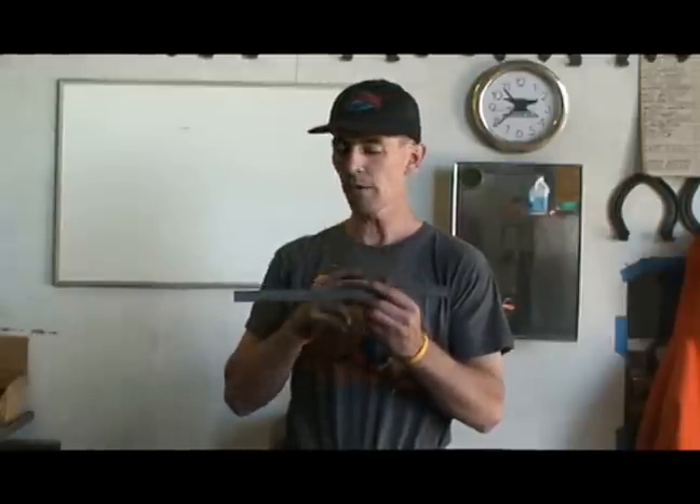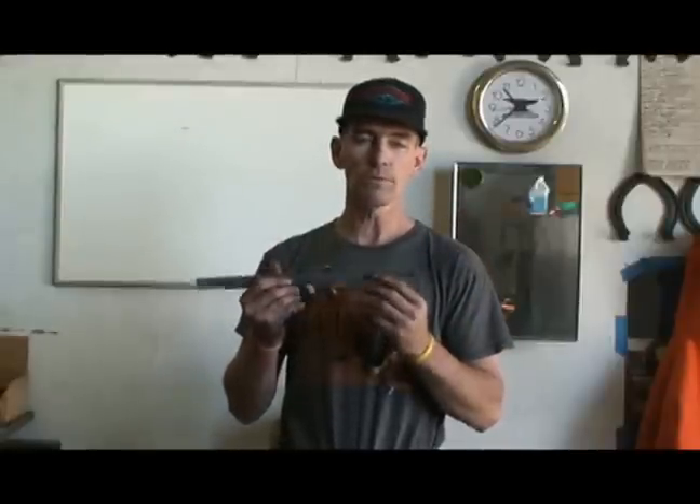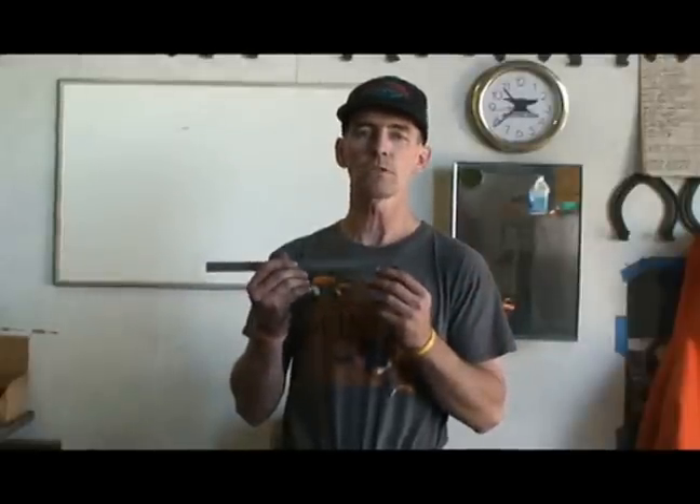We're going to put the mark at seven inches in the toe and just a little over two and three-quarter on the outside heel. That'll guide us through making the toe bend and the outside branch. It's feather fullered in the toe — old school fullering — so basically you start your fullering down and then work it up as you get closer and closer to the toe.